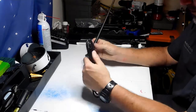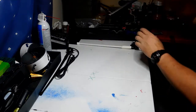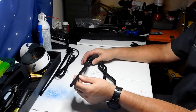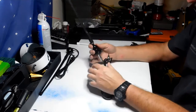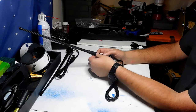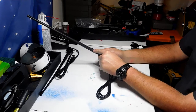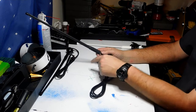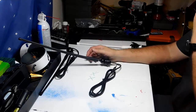This is a car antenna — works great for a car, works great for metal boxes. But if you're going to use plastic or wood, what you need to do is upgrade to a marine antenna. These are made for boats and marine applications, and RVs — because RVs and boats are often made of fiberglass, so they're not made to attach to metal. You see this thicker piece right here at the bottom? That's called the ground plane — this is what takes the place of the car. The antenna actually stops right here, and this bottom part has a coil of wire that wraps around. If you were to uncoil it, it's a very long wire. They've compressed it to basically act as the other half of your antenna.